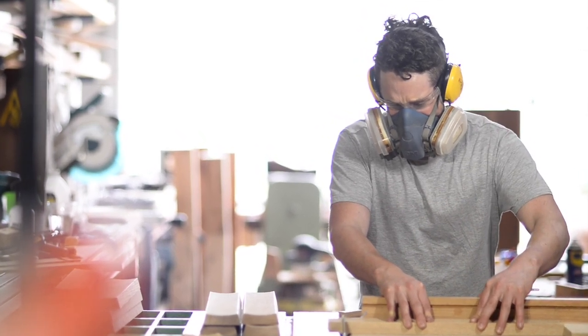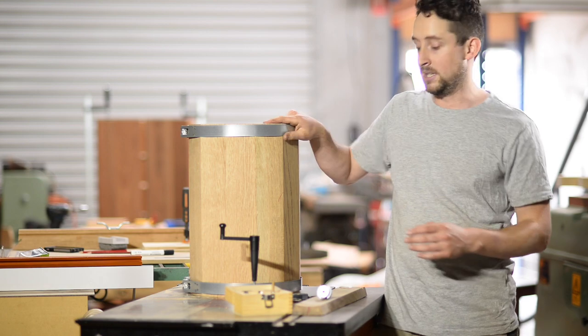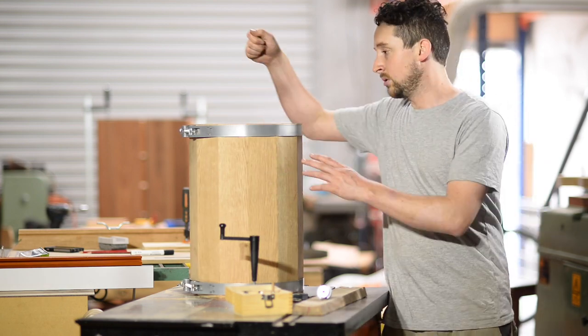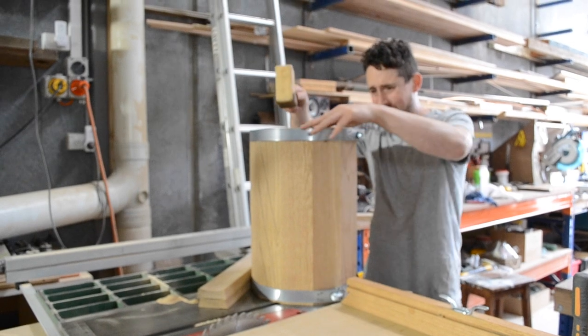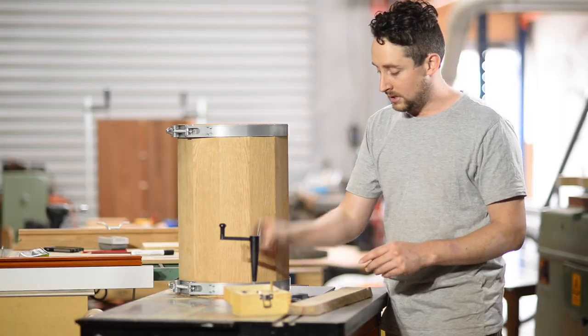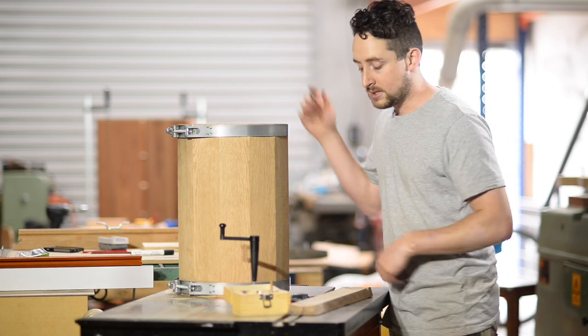However you normally make all your pieces the same length, do it that way, but they need to be exact. I've put them in tightly and used a little mallet to tap them down to make sure they're all even. I'm going to place this rebate bit into the machine and set the height.